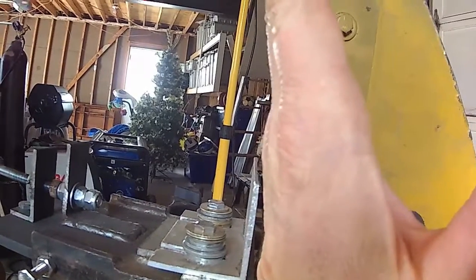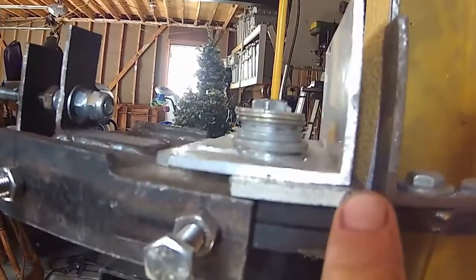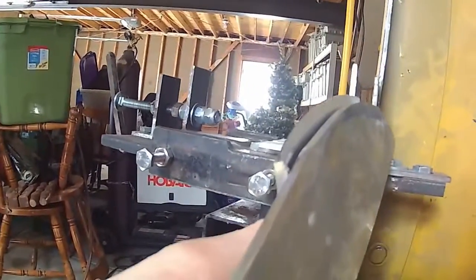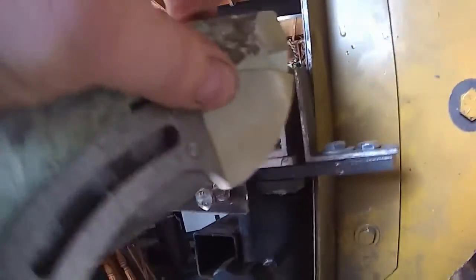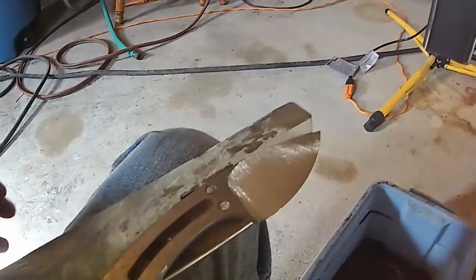Prior to this, the platen was at about 85 to 90 degrees. I've now moved it back to 95 degrees, which is five degrees on the other side. The actual carrier sits a little bit lower than the blank itself. What happens is the carrier rides on this shelf here, and that controls the depth the blank is allowed to go in. Then all you have to do is rock the carrier along that rounded area, and as you rock and slide it in and out, the entire cutting edge passes along the belt at the same height, giving you a proper flat grind.